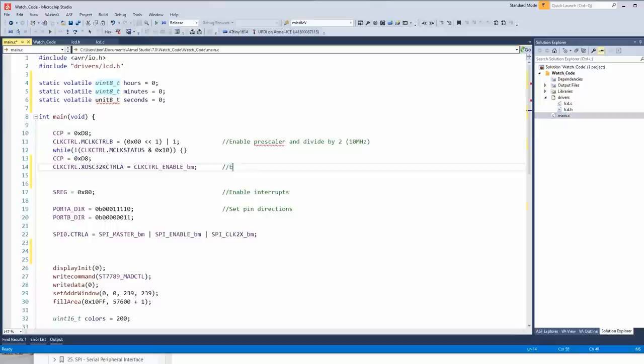So you can't just hook it up. You have to say, okay, that crystal is there. So the pin multiplexers will actually, instead of using those pins as I/O, pipe it in and use it as a clock source. And it's crystal, not the crystal oscillator. There is a difference. The crystal is actually like a little piezo. You have to hit it with electricity in order to make it vibrate at the right frequency, so that's done inside of the chip.